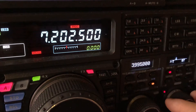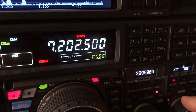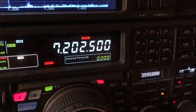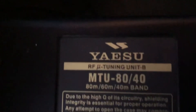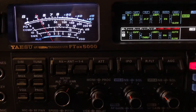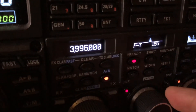Now there's the noise from the other one. Here are the metallic overtones knocking down. This is just tightening the front end of the receiver with high-Q circuits that are inside of the Microtune unit — in this case the 80-40, which covers 80, 60, and 40 meters. You can hear the metallic sound, and you can see how tight this filter is.